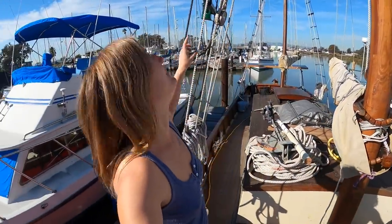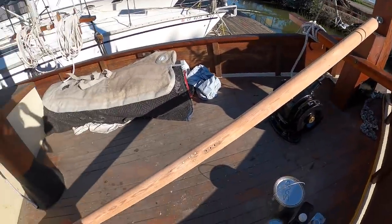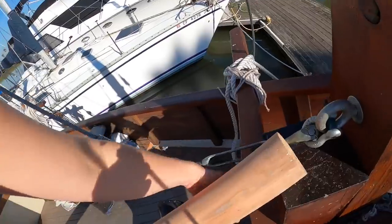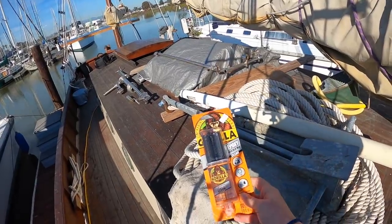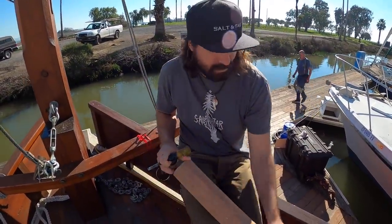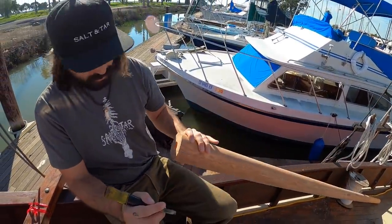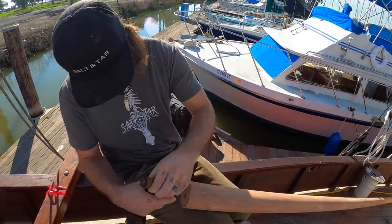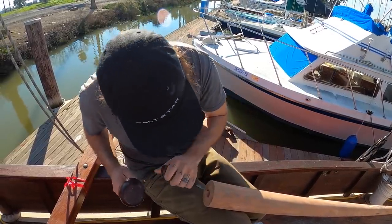We're going to lift it up, kind of dangle it from the ratlines so we can make sure that the epoxy doesn't just fall out of the hole, and then I'm gonna soup it. So here it is. He's already carved out the hole there. And we're just gonna use some 5-minute quick epoxy. I don't need to do anything pretty or visual at all. I'm just gonna take a little chisel and inside of the big hole that I drilled, where we're gonna pour the epoxy and set that gooseneck, I'm just gonna cut some gouges in it so the epoxy will really bite it.